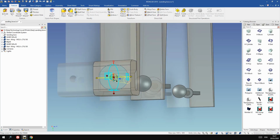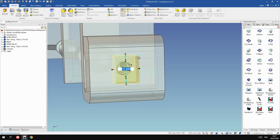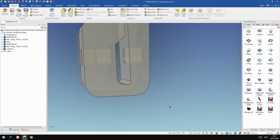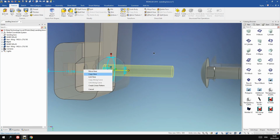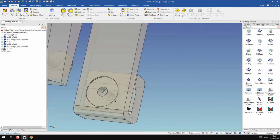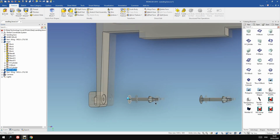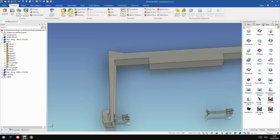The thing is 25 millimeters wide, so the hole is now centered. Put the square in. That's of course the square that's needed by the carriage bolt, because it has a square ending under the head. Now we make a surface for the washer and the nut, wing nut if we're using a wing nut. I couldn't find one yet, but I'll find it. Place that in the right position.